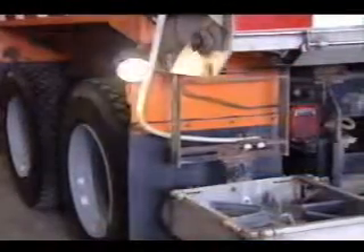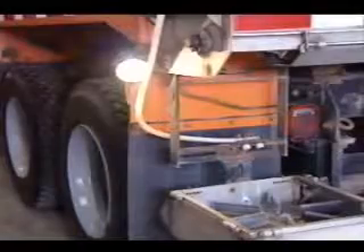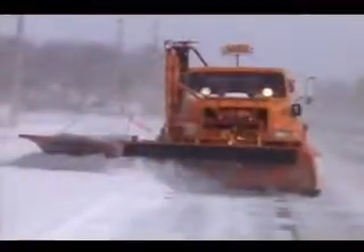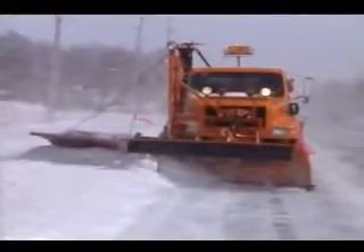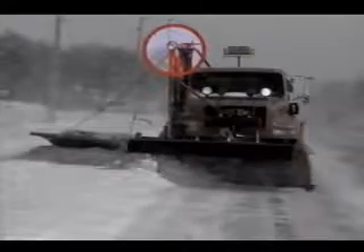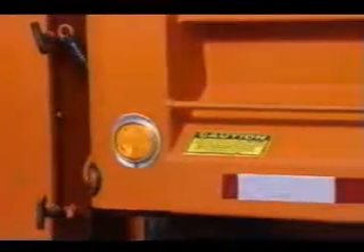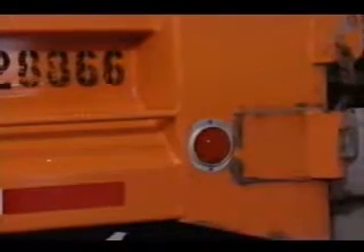The sander light or lights, located on or underneath the back of the truck box, light the spinner so you can see the material being spread. Light duty wing lights, mounted behind the cab, provide light on the wing. Heavy duty wing lights, located high on the wing frame, shine down so you can see the wing at night. The strobe light, located at the back of the dump box, helps make certain drivers can see the truck in poor visibility conditions. Lastly, check that all reflectors are in place — amber to the front and red to the rear on all four corners of the truck body.